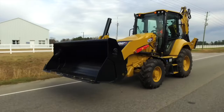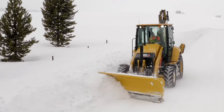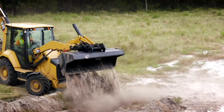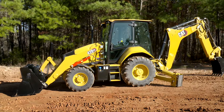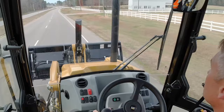With this update, customers will experience better machine acceleration in roading applications and up to 10% fuel savings on the job site, while meeting Tier 4 Final emission standards. Design features from the F2 series have been carried over to the new line of CAT backhoe loaders with some subtle yet valuable updates. The hood has been reshaped with a sharper departure from the operator station to provide better visibility when using the loader.